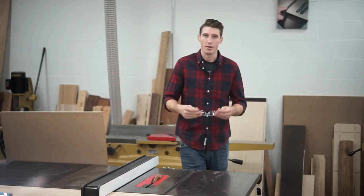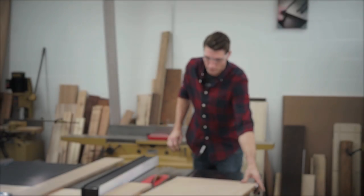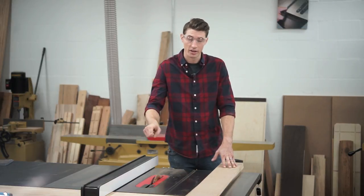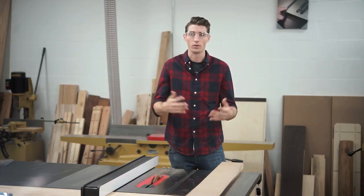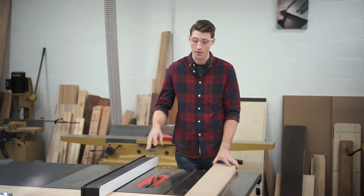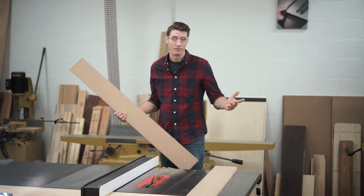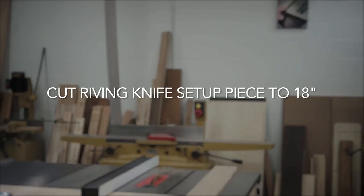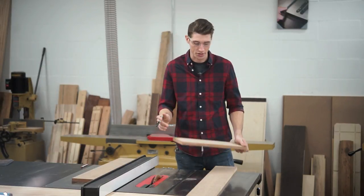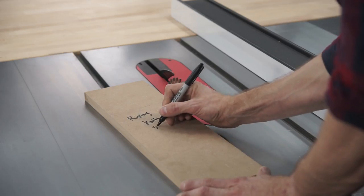So when we're calibrating a fence, we don't want the material to change at all. Always wear eye protection — always. We need one of these pieces to set up our riving knife, so we're going to make it eighteen inches so that it sits on the table both in front of and behind the throat plate, because we don't want it falling into that hole while you have it open. It's very important that once you cut these test pieces, you don't move the fence. We're going to base all of our calibrations on this cut. Here's our five and a half inch wide by eighteen inch long scrap piece that we're going to set up the riving knife with — we're going to write 'riving knife setup' on this.